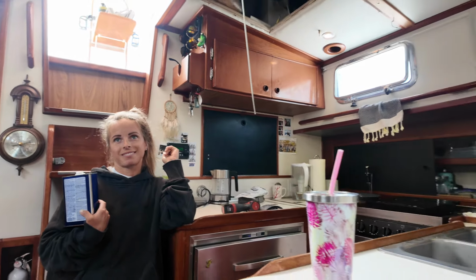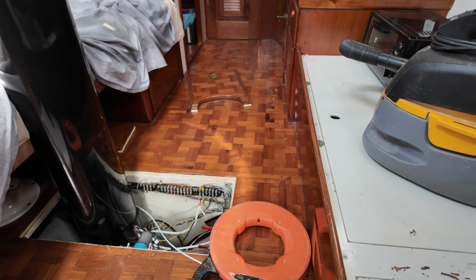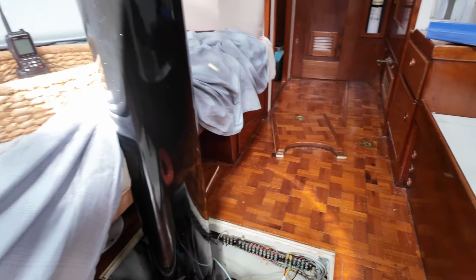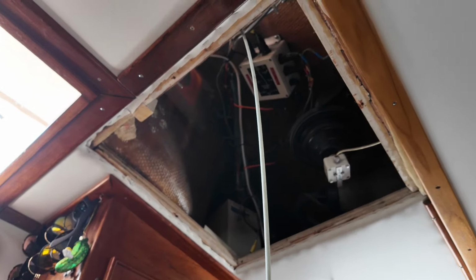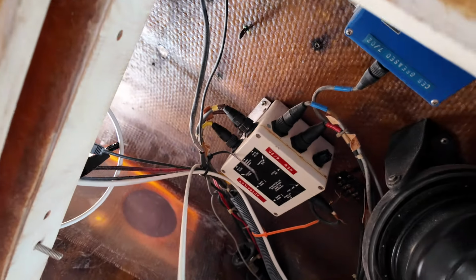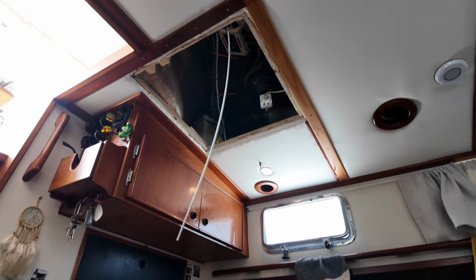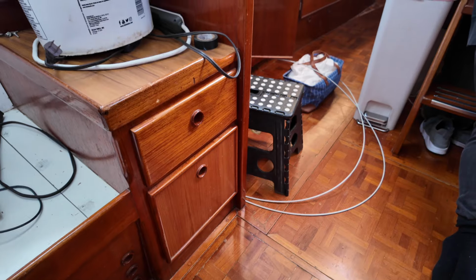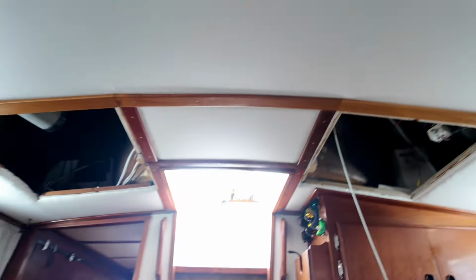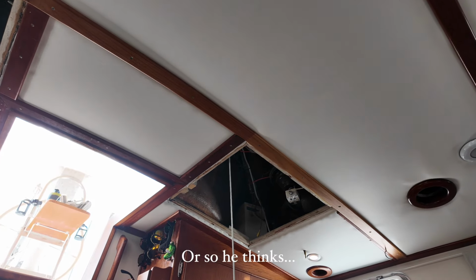But I know what I'm doing, because I got the easiest project I've had on this boat so far. Easy fish tape. It starts down here at the mast, and it runs nice up in here in conduit. Can you believe that? Getting wire from here to here took about 3 hours. But getting wire from the mast all the way up to there is going to be about 5 minutes or less. So I'm happy now.